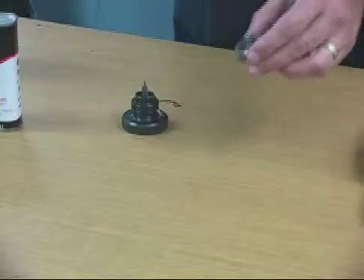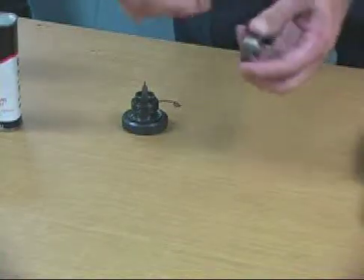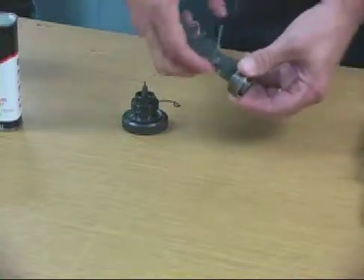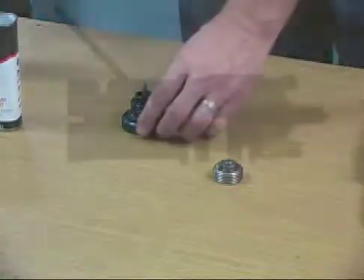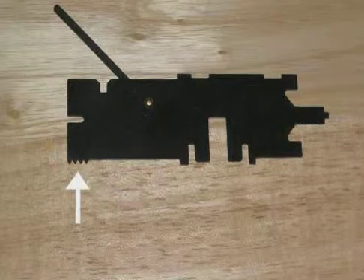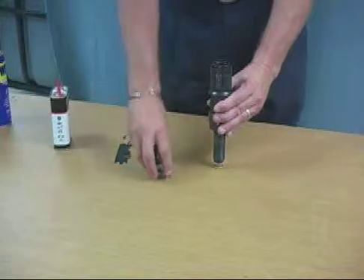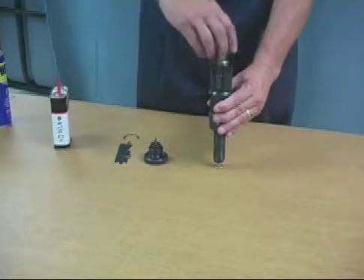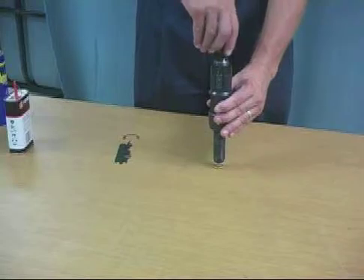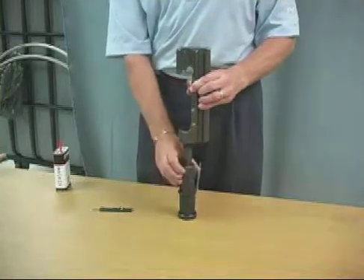Using the cleaning tool inserted into the piercer pin guide as shown, clean the piercer pin guide and surrounding surface. Insert the cleaning tool into the breech cap sleeve, and clean the recesses of any plastic or carbon deposits. Rotate the tool several times to assure proper cleaning. To clean the threads on the gas release knob and breech cap sleeve, use the thread cleaning portion of the cleaning tool as shown, and rotate until the threads are clean. Spray the breech cap sleeve and gas release knob using a good quality cleaning oil. Reassemble the breech cap and replace the spring retaining clip. Complete the cleaning procedure by replacing the breech cap assembly onto the power unit.